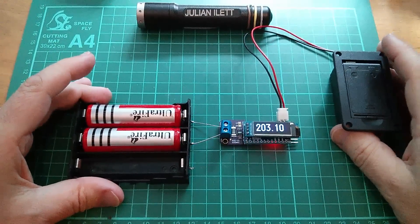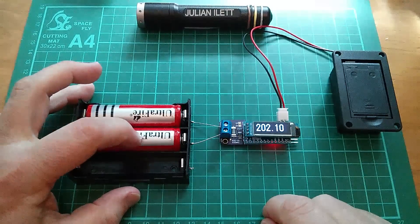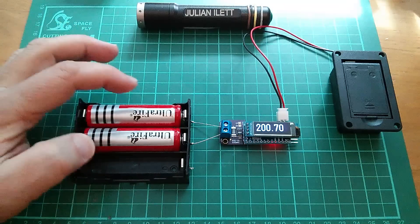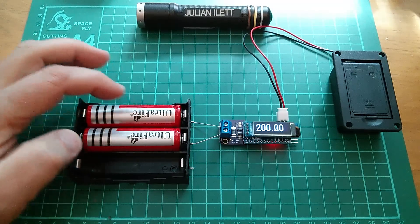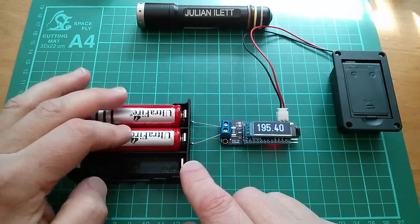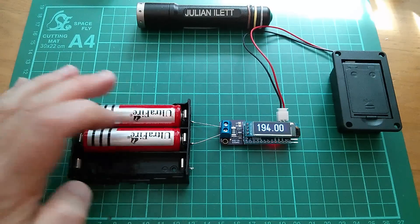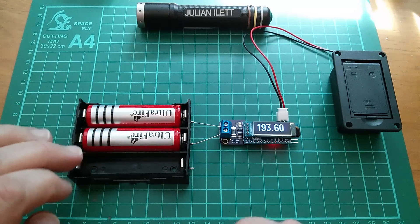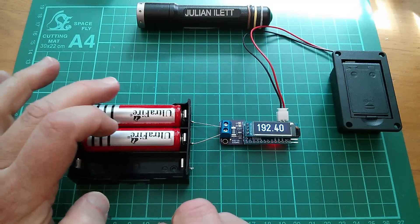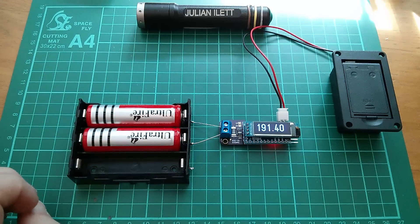This has been sitting here on my bench for about 10 minutes now and there's still 200 milliamps flowing from the charged cell to the discharged cell. Of course they're both sort of balancing out now - there's probably a fair way still to go in terms of energy capacity. But certainly this proves that if you've got these rather poor quality, high internal resistance cells, you can fully discharge one and fully charge the other, put them in parallel, and nothing really bad happens. Now that may not be the case with high quality, very low internal resistance cells, because if you put those in parallel a very large initial current will flow - I'm not going to try that experiment because it's a bit stupid.